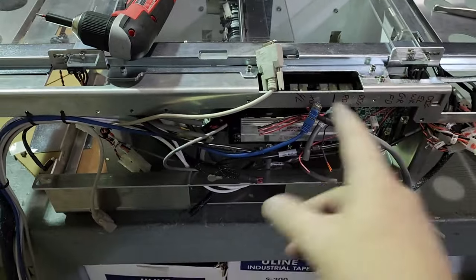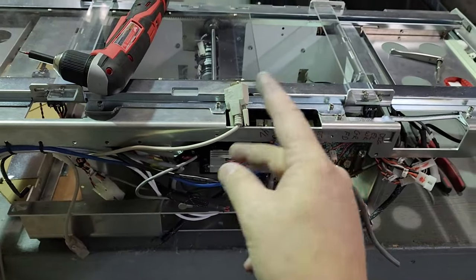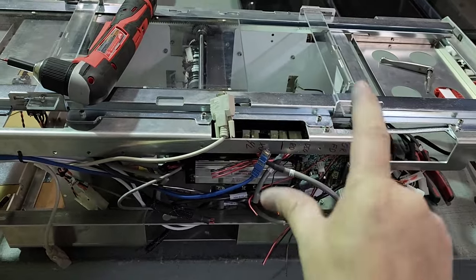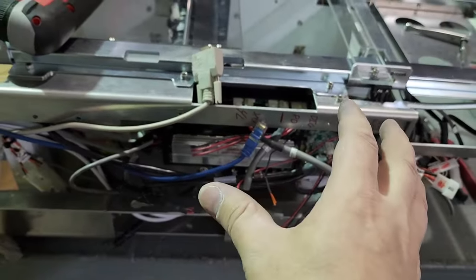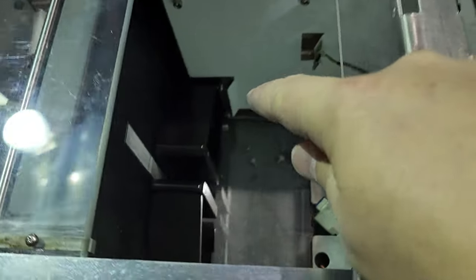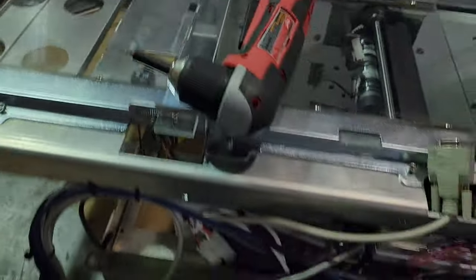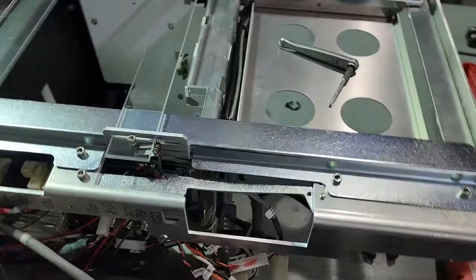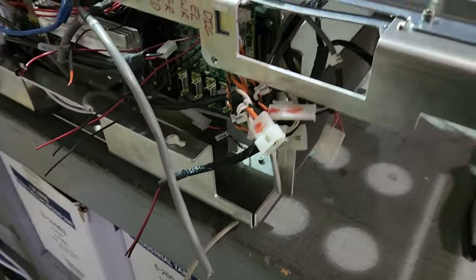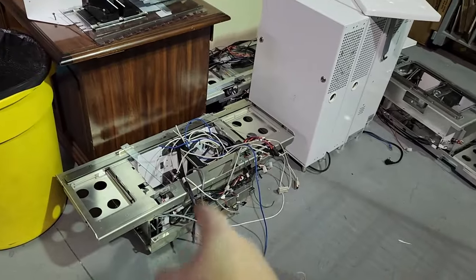Inside this device you put pills into it and it registers them somewhere on a shelving unit. When recalled, the servo controller moves X, Y, and Z — plus rotate and other functions — and stages into the binned areas where there's a camera, infrared detectors, positioning sensors, and the pill counter scale. All together they communicate what is being transferred, the quantity based on weight, and the camera records a permanent record of what's being sent out. I've already got one of them all torn up and scavenged.